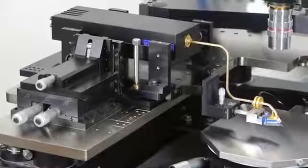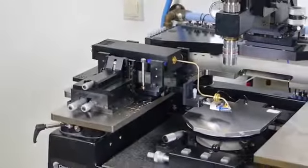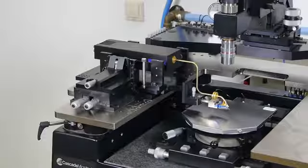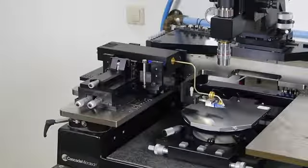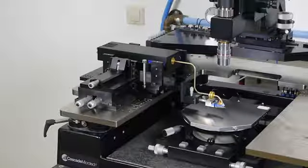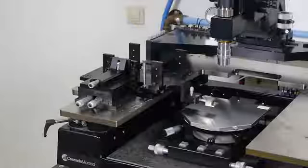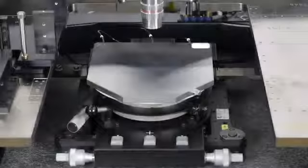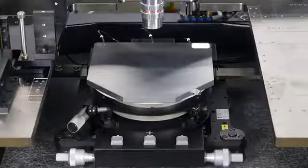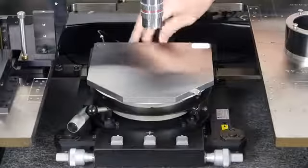For higher frequencies, especially above 220 GHz, it's more and more important to have minimum losses in the connection between the module and the probe. For this we have a solution too: direct probe mount. Remove your current setup from the Sigma kit and remove the front arm. We start with the mounting of the chuck raiser under the chuck. The stage offers a very easy bayonet system for this, so no tools are needed to mount it.